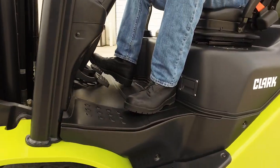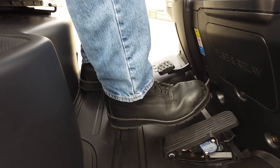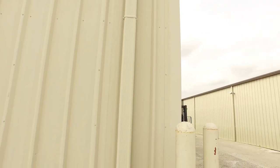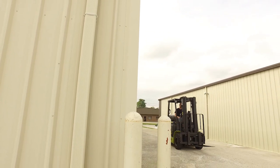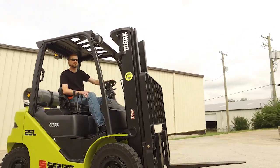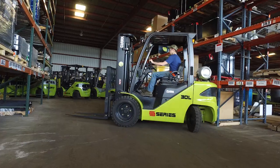The brakes on the S-Series lift truck are designed to last the life of the truck for most applications, so there's no need for costly routine brake jobs except in extreme applications. The brake system self-adjusts if brake disc wear occurs. There's no brake squeal and no brake drums to remachine during brake jobs.